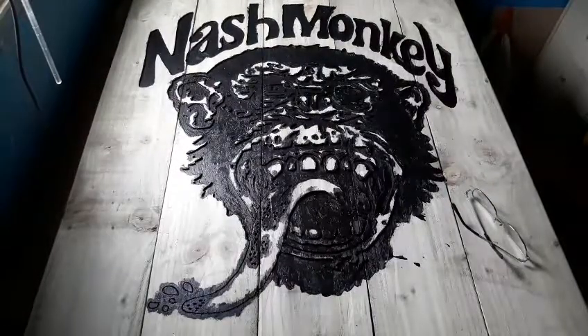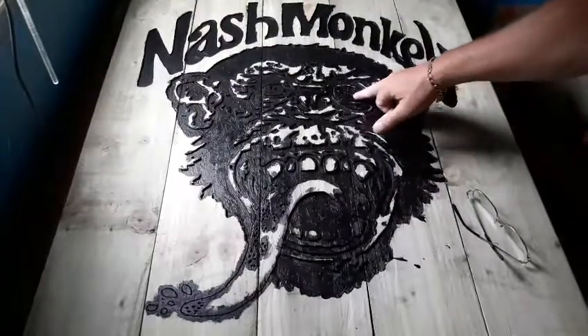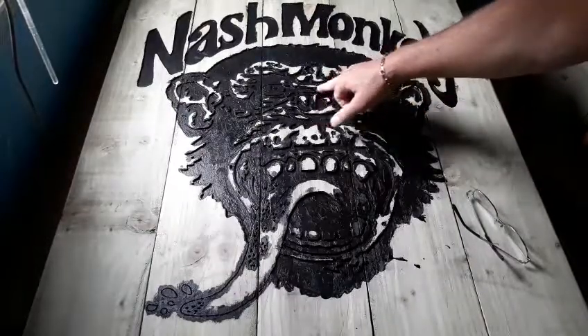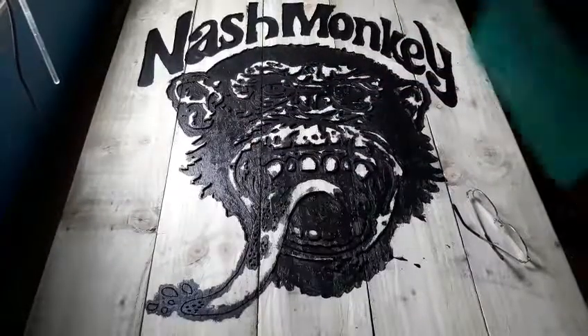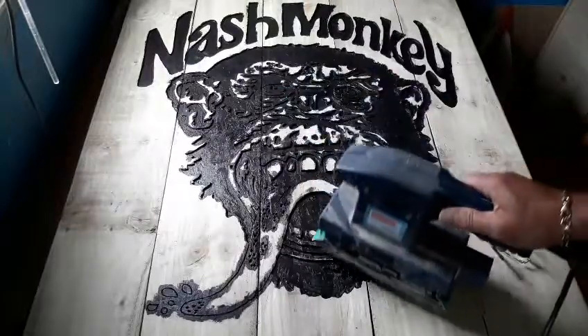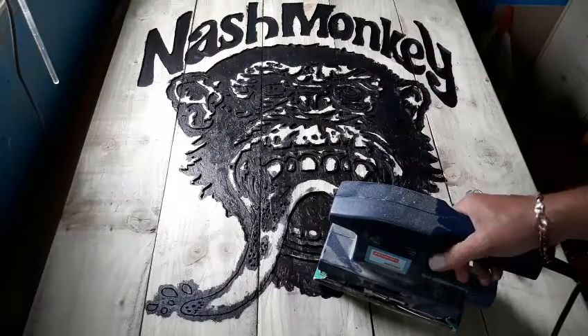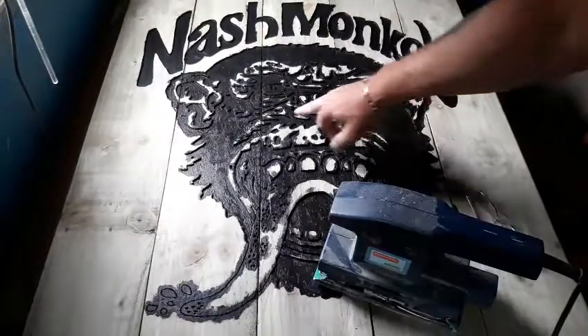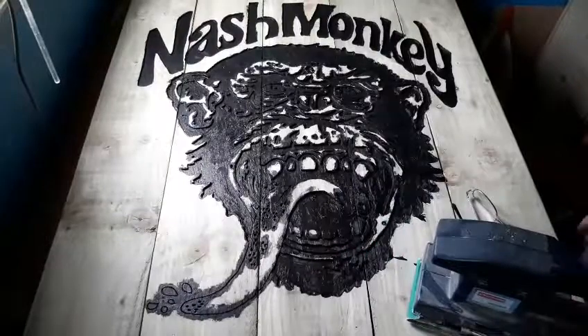Right, that's all painted and we're ready for sanding. Now to be honest, it's quite a big piece so the belt sander would be better. However, I think it's a bit aggressive for this kind of wood, especially around these areas here around the eyes - they're going to be quite delicate. There's little bits over here that are going to come off. So today I'm going to just go with a little sander, and even this could be a bit delicate. Might end up using a burr on the Dremel just for these really small bits, which I feel might just pop off. Anyway, I'm going to give it a go, so let's get a mask on and get on with this sanding.